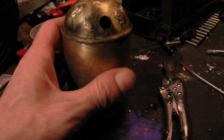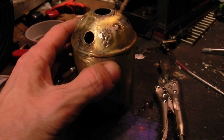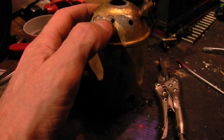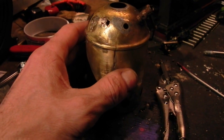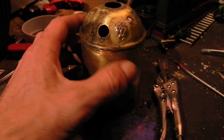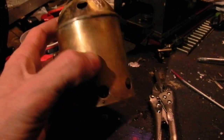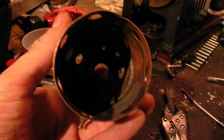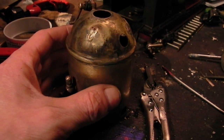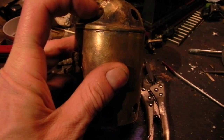We're cleaning it up. We've begun to fill those cracks that were leaking on the top with medium silver solder — this is jewelry silver solder — and patching up some gaping holes where the brass was just so thin. After sanding and filing, I've found probably ten weak points in the dome that I've fixed now. There's still probably a small crack here to fill.